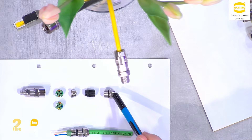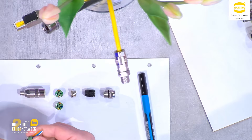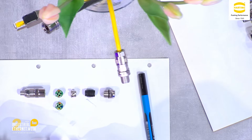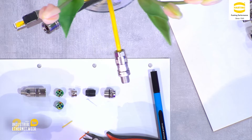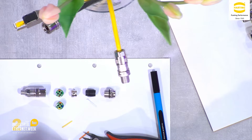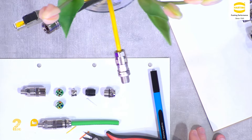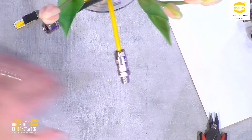I prepared something in advance so you can see it. We have to put the cable through the lock nut, through the sealing and the shielding element, and finally bring the single wires to the wire manager. Then we cut off the single wires, put them in the right direction, and screw everything together. You can see how easy it is to assemble this kind of connector. We offer this M8 connector solution in different variants: male, female, and a push-pull version with the Harting push-pull system.